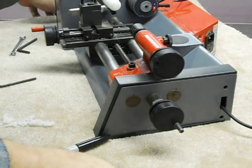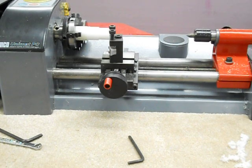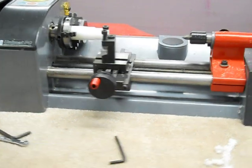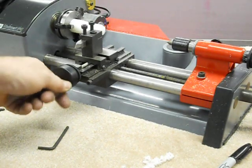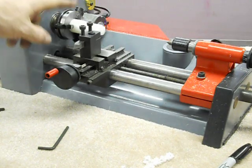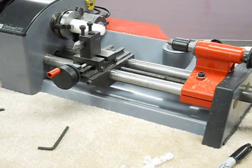This one is also quite a bit more sturdy than the SLs and the DBs. It does have the round ways but they're actually substantially thicker, and it's also got a cast iron carriage. It's a much longer stroke than on the SLs, DBs, and the Unimat 3 — probably an extra inch in and out. The diameter of the workpiece you can use with this lathe is actually quite a bit larger than the Unimat 3 and Unimat 4.